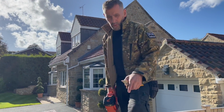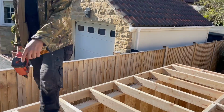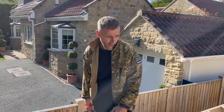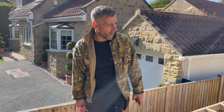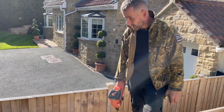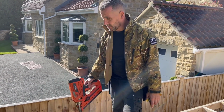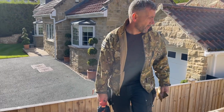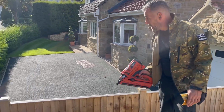Right, so we've put the roof rafters in, we've put the end trimmers in, we've put the back trimmers in, the side trimmers, we've put noggins to carry them, we've cut noggins, 2 rows of noggins all the way down the middle. All that's left to do now is I'm going to go around and spike these back timbers down, because obviously John fixed them up from underneath. I need to spike them down, stop any wind uplift, which will rip your roof completely off your building.